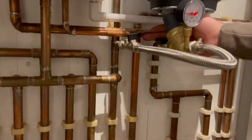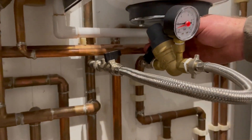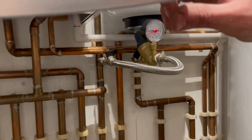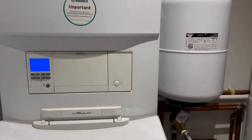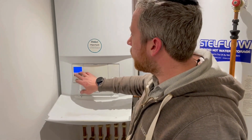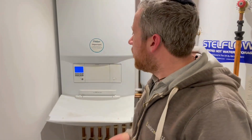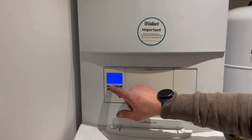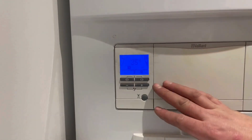I'm going to turn off both valves. There's the other valve — I'm going to turn that one off. Now they're both not in line with the pipe, and that's basically how the valves should be when off. Once you finish topping it up, the boiler will start going into a cycle and it will start purging the air out of the boiler.